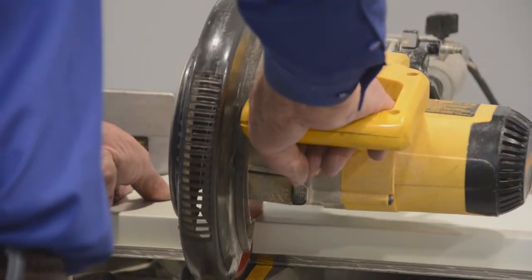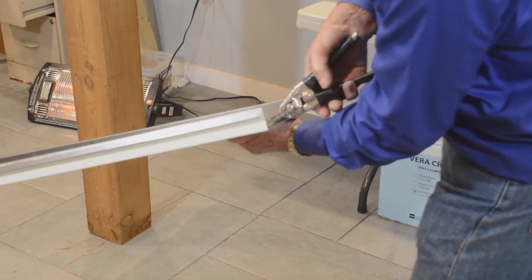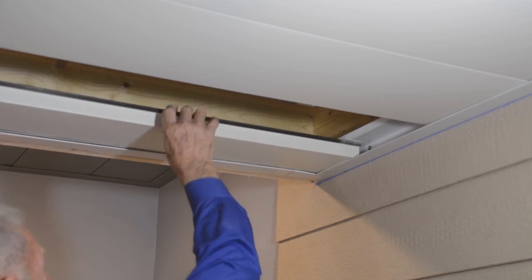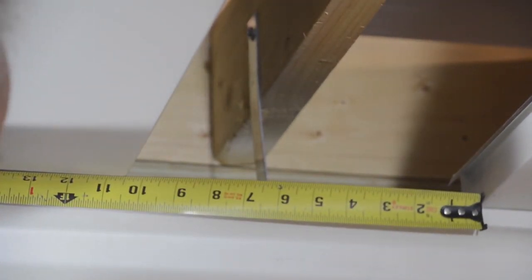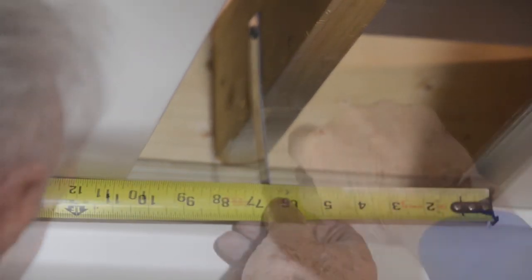Cut the panel to length. Then bend the end of the panel to stiffen it. Insert the modified sealing panel in place into the wall channel and over the gutter. The sealing panel is 10 5/8 inches wide. Adjust the opening for the next to last panel to accommodate this.